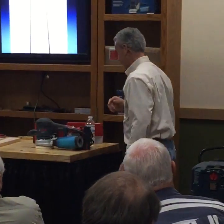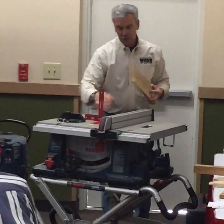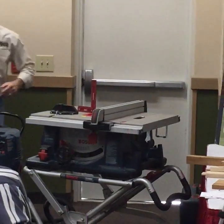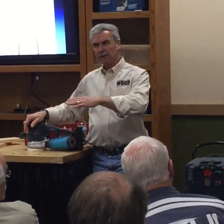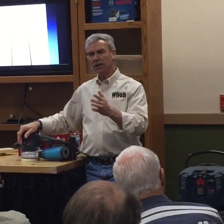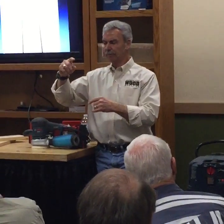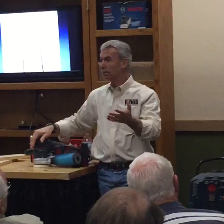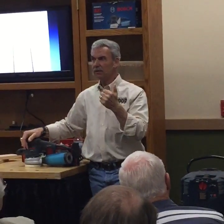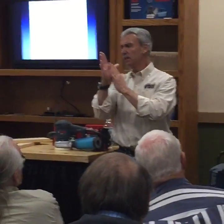The big issue on a table saw is this. When you first set up your table saw, everybody, you made sure it was 90 degrees to the blade, to the table. But if you've ever taken that off of 90 degrees, 30 degrees, 45, something, and put it back up again, there's a real good chance it's not back at 90. A lot of those old saws have a very rudimentary way of adjusting them. They have a screw thread. There's a stop on there with a little Allen wrench on it that indexes someplace up against a plate of some kind. Anything that gets on there, the sawdust and plywood, the pitch or gum from cherry or poplar or pine, anything that gets on there can keep that from indexing back at 90 again.